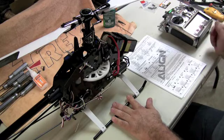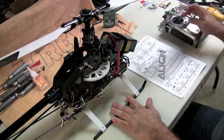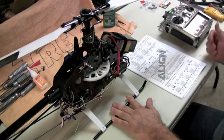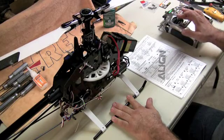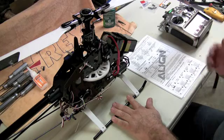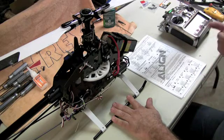Now it's going to give you 5 seconds to set the preferred brake mode, which is disabled — we're going to leave that at the low stick position. That's where braking mode is set. Now the next thing is to set the preferred timing mode — we're going to leave it at the default mode. Move the throttle stick to the middle position and it will go through a series of double beeps, confirming the throttle stick is in the middle position.